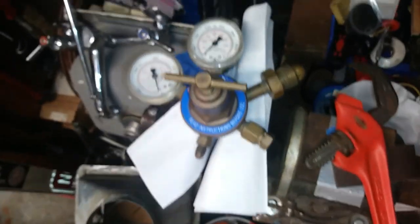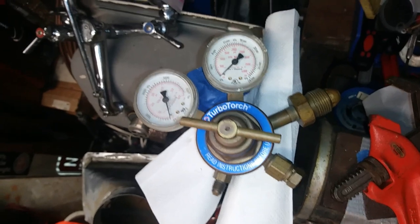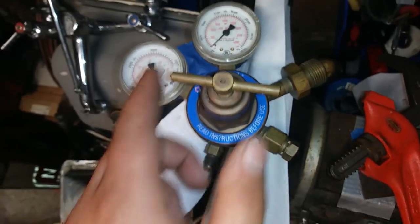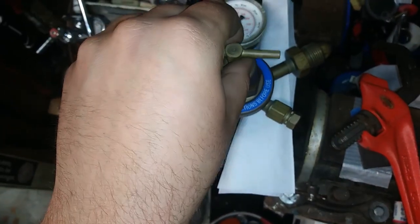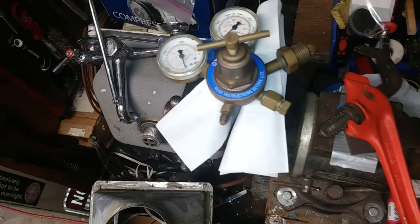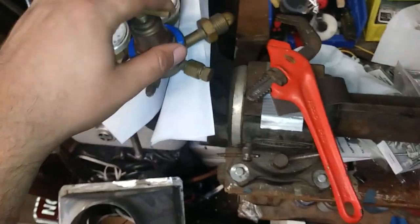Today I'm going to be trying to rebuild this nitrogen regulator. I've had it for quite a few years — it's been sitting in the garage for almost a couple years now. It stopped working properly: it doesn't regulate down to the minimum setting. Even if you try to turn it all the way off and take the set screw out, it'll be leaking by too much nitrogen — though not too much for a reasonable brazing purge.